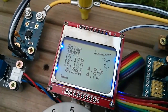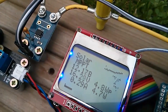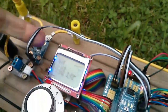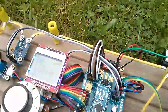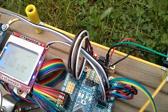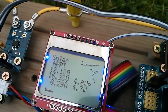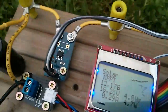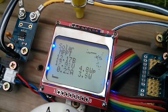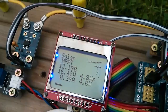I'm occasionally seeing a little bit of movement on the amps reading. The big capacitor is on the filter pins of the amp sensor, the ACS712. I'm wondering whether the wire from the ammeter going through a coil near the PWM signal at 15 kHz is causing that — probably not the cleverest idea and I might reroute it. But it's quite a stable amps reading now, much better than before. The volts reading with the 'V' after it is the input-side solar panel voltage.